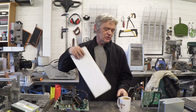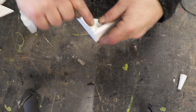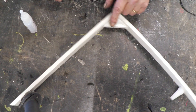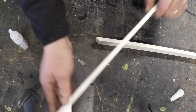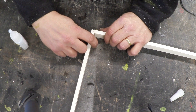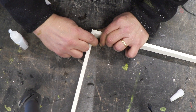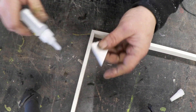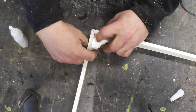We're going to build the box out of this material. It'll be made out of a frame basically, so the first thing is to get a frame made up. Cut four pieces to the length you want, mitre them at a 45-degree angle on the end, put a bit of glue on, and squeeze them together. I make these little triangles to go in the center - that keeps everything square. A bit of superglue on the edge, line them up, squeeze together, and pop the triangle section in. We need to make two frames.